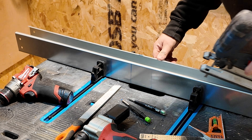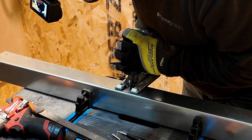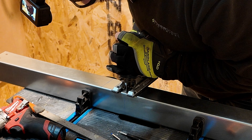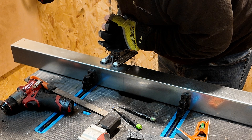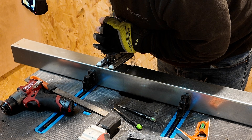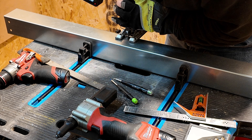I'm using a jigsaw for all these cuts and I'm just taking out that little triangle on the lip. You can use an angle grinder, a chop saw, or a hand saw — whatever you wish. I just find the jigsaw simplest, quickest, easiest, and safest. You've got to be careful when you're approaching the edge because if the saw were to grab the back of the trunking it would spit itself about a little bit. I've got my head camera on for some close-ups on the blade, though I think I got the angle on the camera a bit wrong.